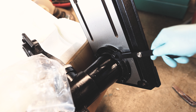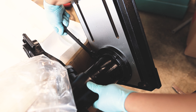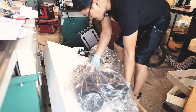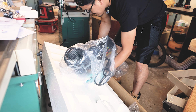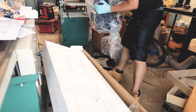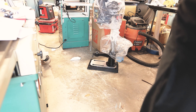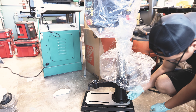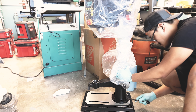I'm only connecting three of the bolts because I couldn't get to the fourth bolt, but once you have three on there and you tighten it, you'll be able to stand it up and it'll be stable. Now I can get rid of the big ol' box now that it's on the base and it's standing up. With the drill press in the upright position, I'll go ahead and install the final bolt and the two washers. I'll also re-tighten all four bolts just in case.